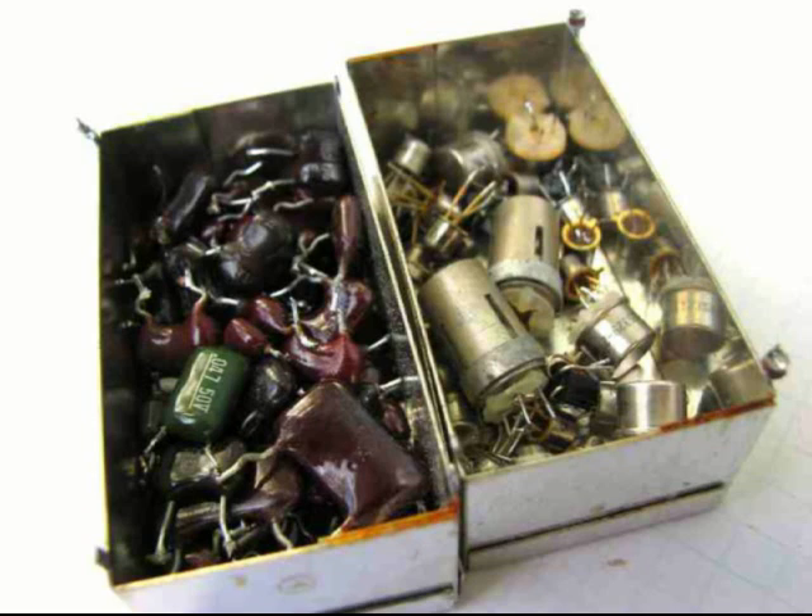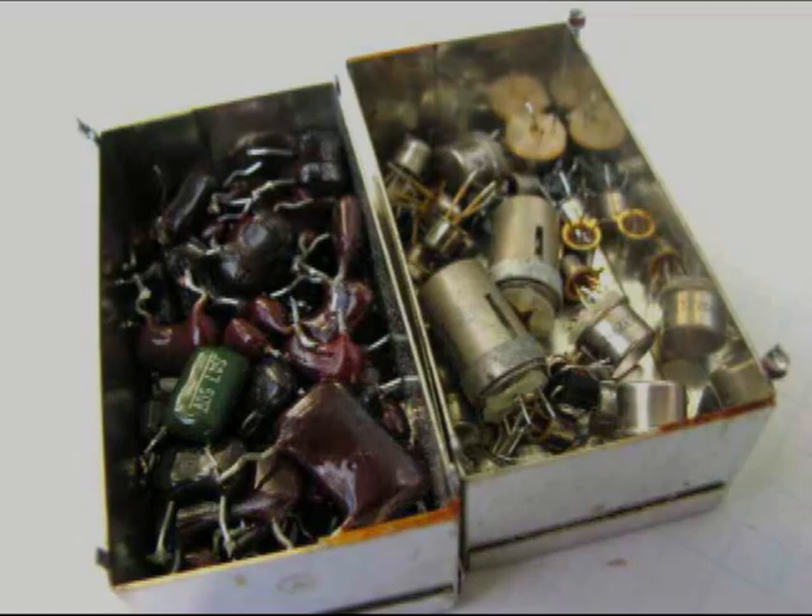Another nice thing about the box full of stuff I got there was these nice little pre-tinned steel enclosures, so I can build a filter onto a homebrew piece of copper clad board and then drop these walls down around it. The lid — which looks more like the bottom of the box in the picture — pulls off easily without any tools, yet offers a nice clean RF seal for shielding that has a user-friendly nature in terms of opening or enclosing.